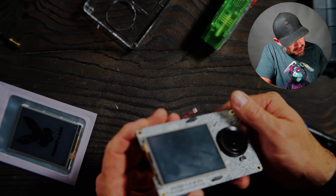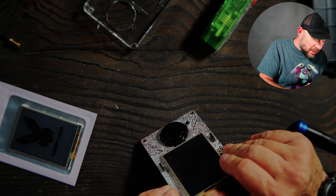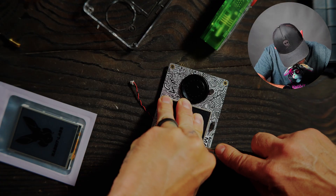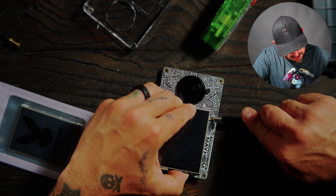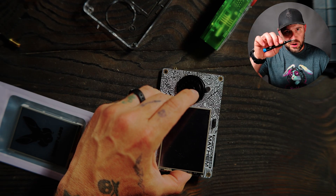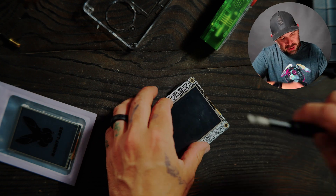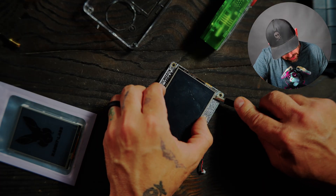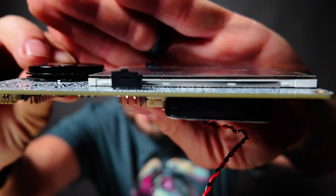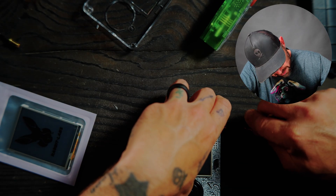Now getting the screen off is going to be something new — this is the lesson that wasn't in the book. Without breaking it, because what if I decide to use this for another project down the line? I'm assuming this screen is stickied in place. I am just being super gentle, just doing a real light pry. I got one side up and then I don't want to just peel it and break it, so I'm going to do the other side now in the same fashion. There is this little bit of metal plate along the side of the screen — just be aware where you're applying that upward pressure that you are underneath that plate, because it seems to want to just lift away from the screen itself.